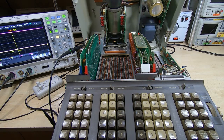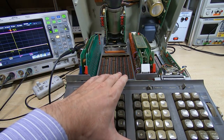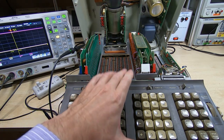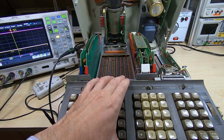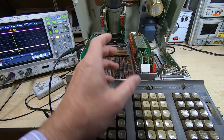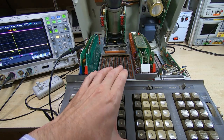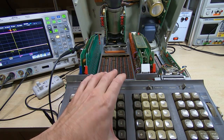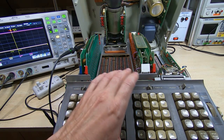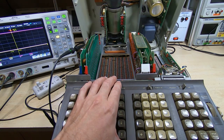This is part three in a series of videos in which I am attempting to repair two HP9100B calculators. These are very interesting machines designed back in the 1960s. They are basically DTL machines — diode transistor logic — with thousands of diodes and about 750 transistors. There are not really any ICs in this at all, just a few, and not really in the logic paths.